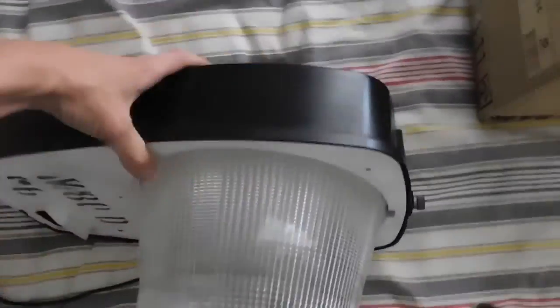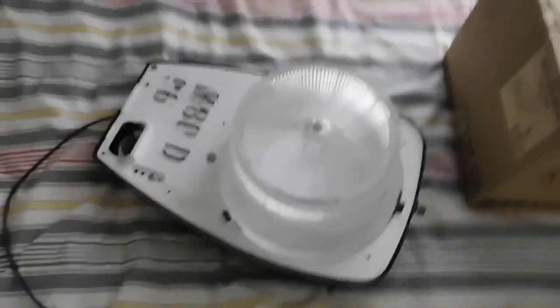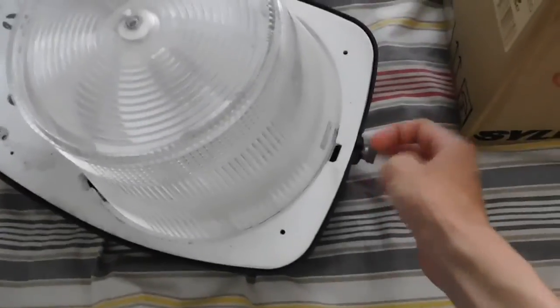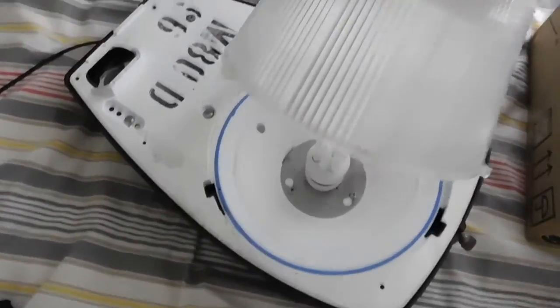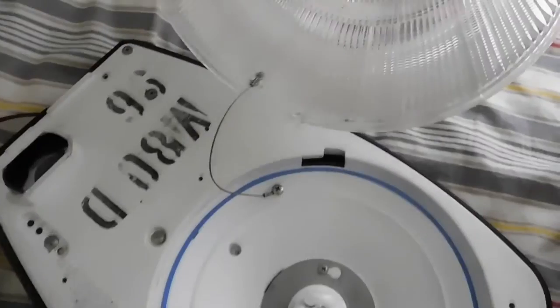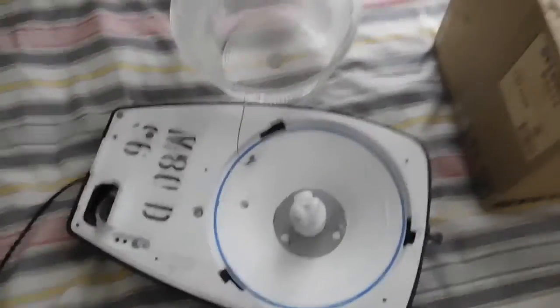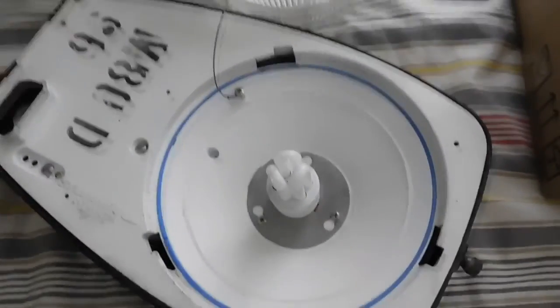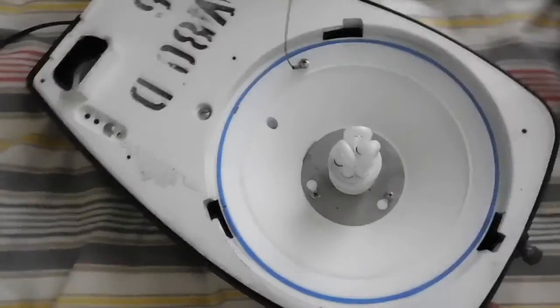I figured we'd do a bit of a look around on how these are set up, since there aren't really any decent videos on these street lamps. In terms of getting the diffuser off the front, it's very easy — you've got a single bolt here and then it's just a twist lock and take it off. It's got a little wire actually holding it on, basically for when it's mounted up on a spigot on a power line cross arm or something, so the thing won't fall off while you're trying to work on it.